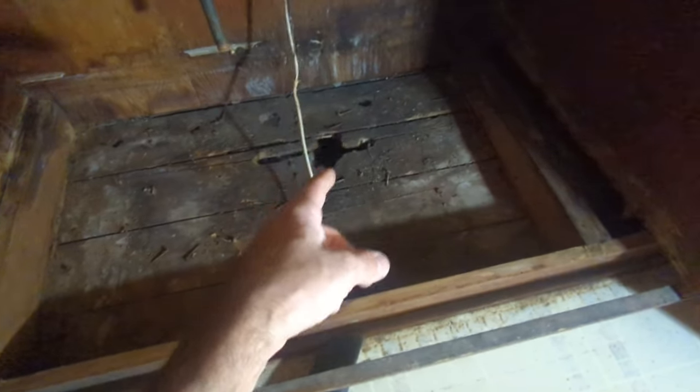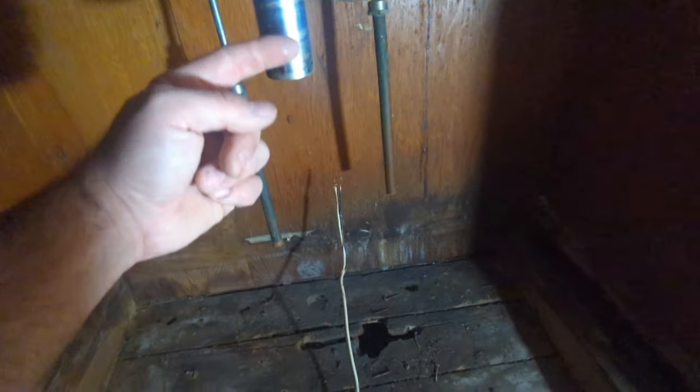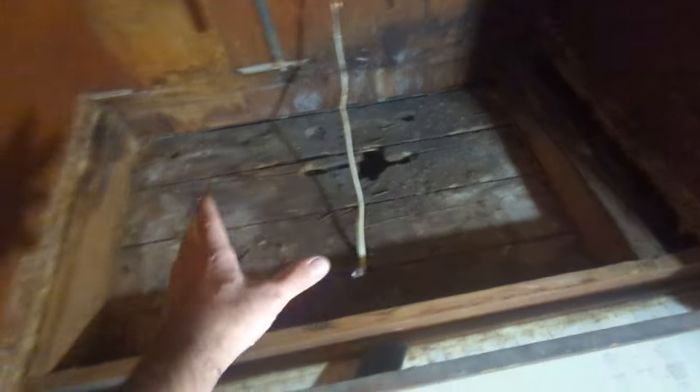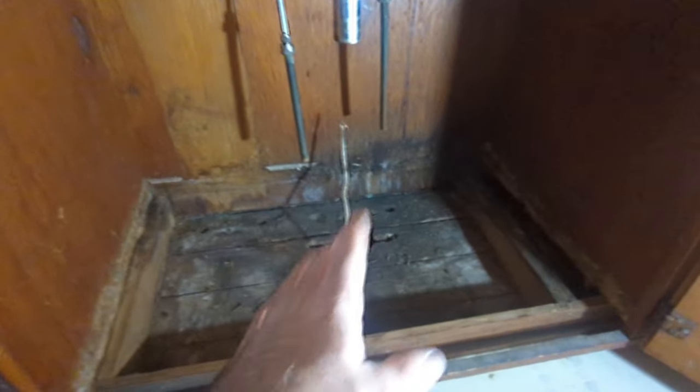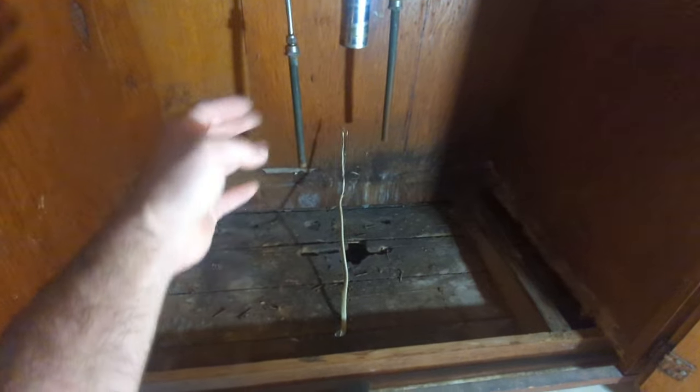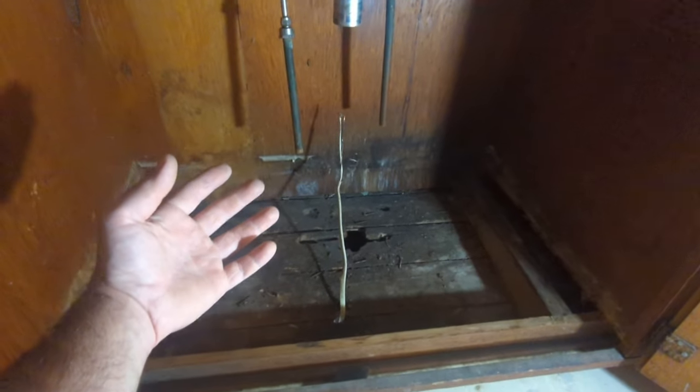And that's because, to start with, this had what's called an S-trap. So it came down from the sink, it did an S, and went straight down through the floor underneath the sink in the kitchen. A lot of older style places have got something like that. It does keep your drain out of the outside wall of the house, which was typically cold and could have frozen, and so that was the thinking, I think.